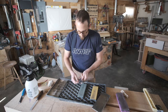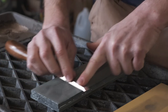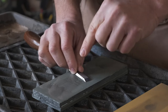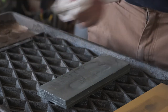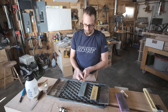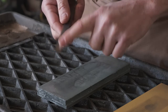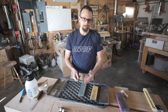So all we need to do now is take the burr off. I'm going to set the chisel down with the tip hanging off the stone, and slide it side to side as I drag it onto the stone. The hope there is that as I pull it onto the stone, the burr falls off on the edge instead of sticking in the soft stone and contaminating it. So that chisel is sharp. All I need to do now is wipe it down with my oily rag to prevent that water on the fresh edge from blooming and rusting. Each time I sharpen, the first thing I do is take a few swipes across the fine stone on the back of the chisel to keep that polish up — that way, as I remove material sharpening, the polish moves its way back and I don't have to do a dedicated polishing session as the chisel gets used up.